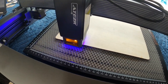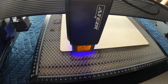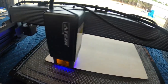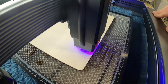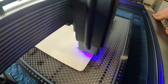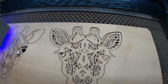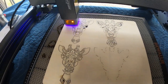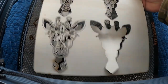Moving over to some six millimeter — I tested three and six millimeter, and it was the fastest I had. Look at how quick I'm cutting right here. This is just flying through that stuff. I'm cutting out a piece from their website — they give you free designs and graphics you can cut out. This is a giraffe. You can do multiple layers, running on a 12 by 12 three millimeter board. This is by far quicker than I have ever cut with any diode laser. A few minutes later, everything's nice and cut. Lift the board up, pieces drop right out. They look awesome.